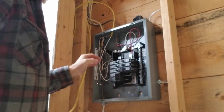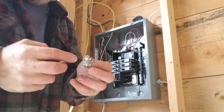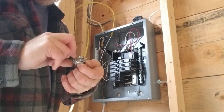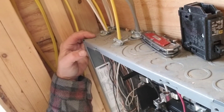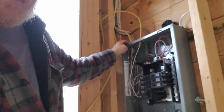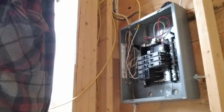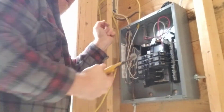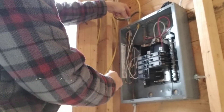We've already run our wire previously before we finished up the barn, so we're going to take our romex connector and put that in the top. Word of caution on the romex connectors: when you tighten the two screws down, just snug them up so the wire doesn't move easily — don't crank them right down because you will damage the wire, which could cause a fire or nuisance tripping of your breaker. We'll knock out the appropriate knockout at the top of the panel — grab it with pliers after bending it, break it off, and control it so it doesn't fall into something live.